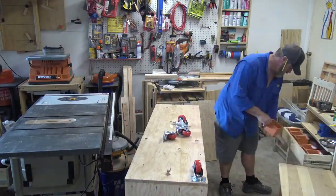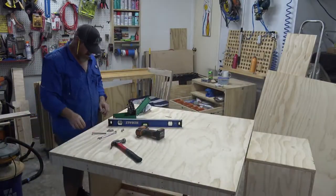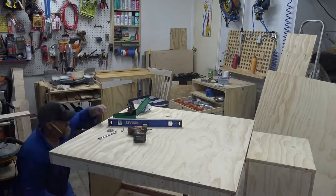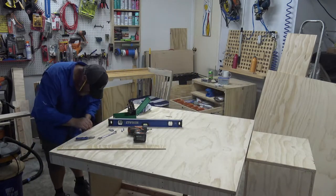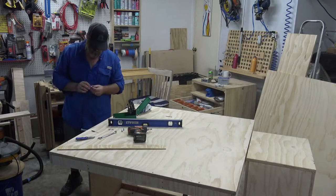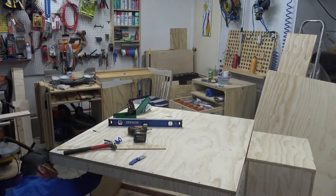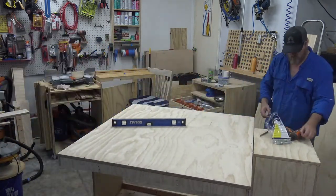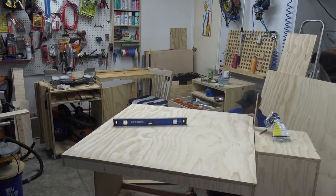I'm going to go ahead and attach the casters. I actually need some washers because the screws I have are a little too small. Here's something I never saw online: I made some blocks to get this up to where I wanted it, then screwed it from both sides so it was rigid. Then I ran my three-eighths drill bit through where I wanted to pivot on both sides and ran my bolt through that. I used some washers to space out a quarter inch on each side on the inside so I'd have free-flow movement with my actual table, and then I just removed the screws.